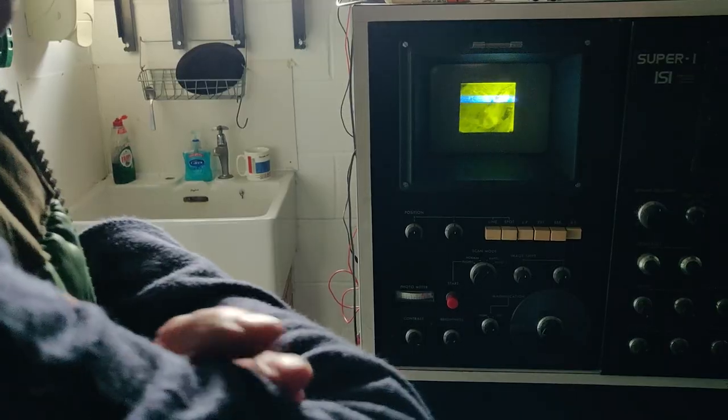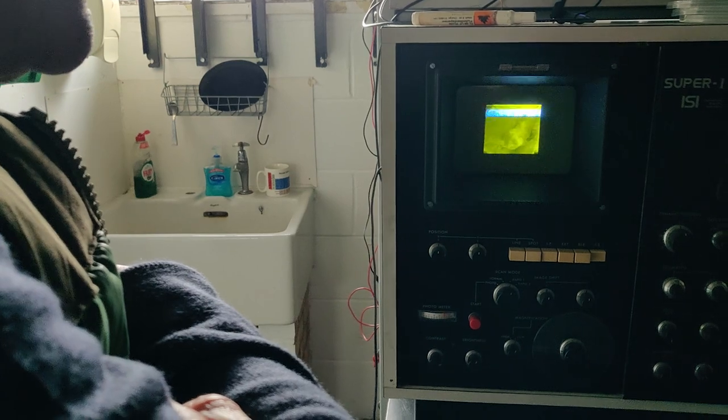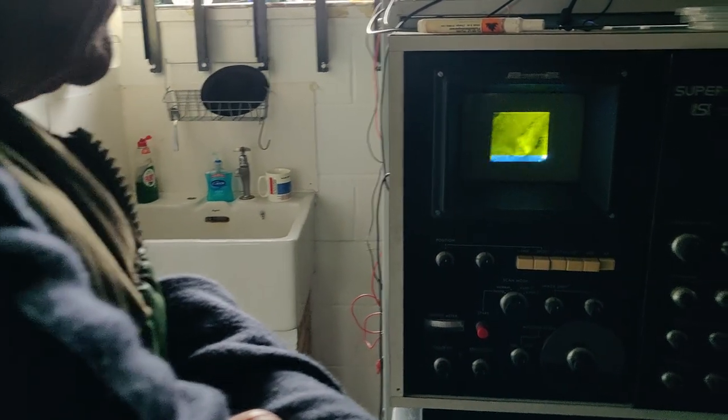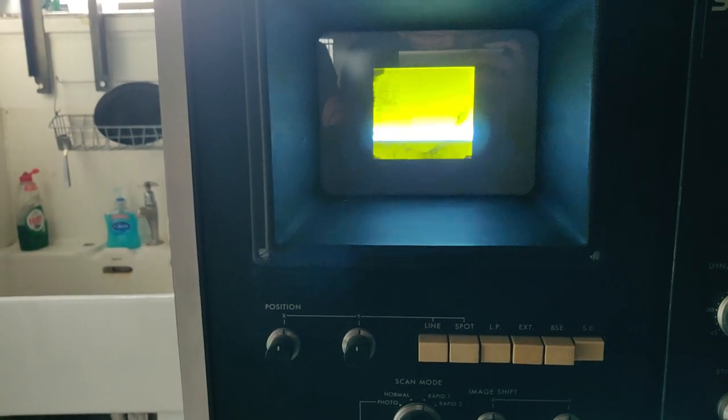There's a full sized image setting you're using. Oh, wow. So that's low mag. What I've done is I'm up to 80 microamps, which is probably about where we need to be. But if I turn it down, you see, what we're doing, we're coming through. I would think I need to tweak these around a little bit. Yeah, it's offset slightly. That's the right way. That's better. Turning down a bit more, and a little bit more.